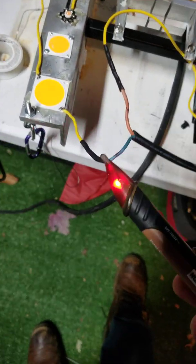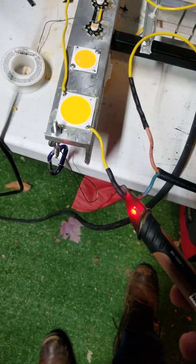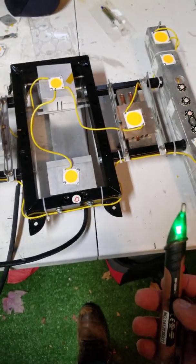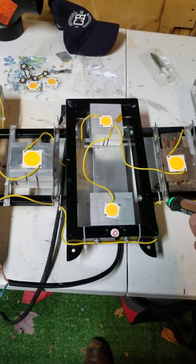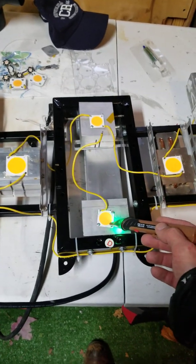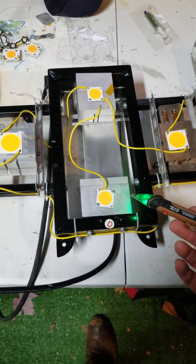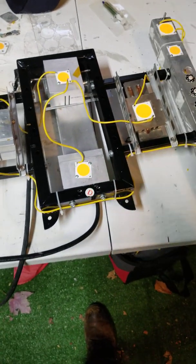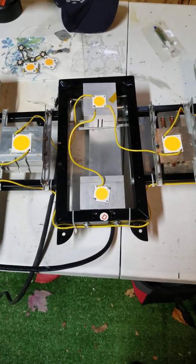From my research, I can indeed start with a negative. I just don't understand why it's not turning on. We've got 286 available volts coming out. I thought maybe because the eight COBs add up to 288 volts that could be the issue, so I just disconnected one COB to test that, but no. So I'm at a loss — any help would be much appreciated. Thank you.